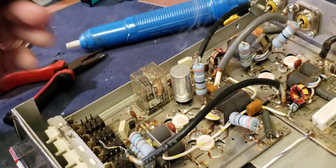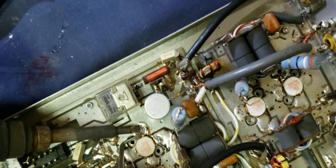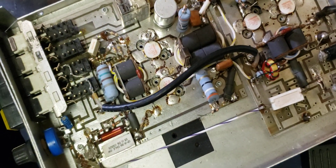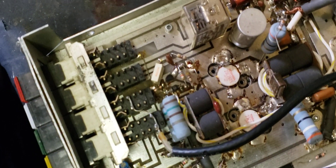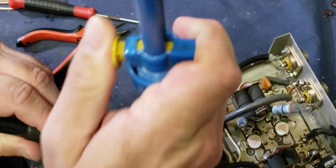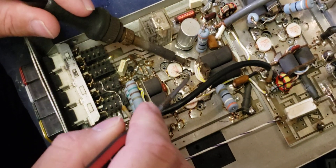Sometimes I like to put a little bit of solder on my iron before beginning. You want to make sure you ain't hitting that relay. I'm starting with this emitter right here — moving back and forth, got it lifted up a little bit. I'm gonna take my pick and just bend that lead up like that. There's still some solder on that lead, so I may try the solder sucker and get lucky and suck all that out. I sucked a good bit of it out but not all of it, so I'll continue on to each one.